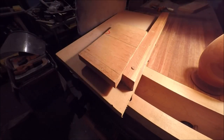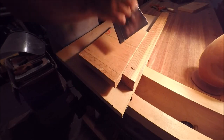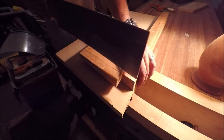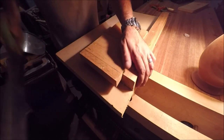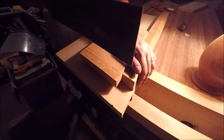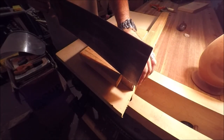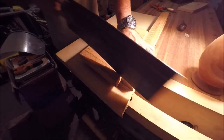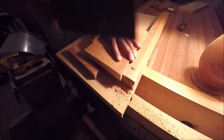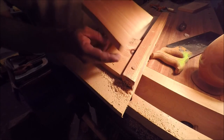It's always a good idea to use a little paraffin wax on the saw — makes things cut a little easier. I think there's an issue with this saw; I probably need to go through and sharpen it up again. I've got a line right here, and normally you'd drag it back like with a big crosscut carpenter's saw, but with this one that's not necessary. There we go — that's scrapped. You can see the knots here; pretty much got them all out except for a little bit, which we'll get in an upcoming step.